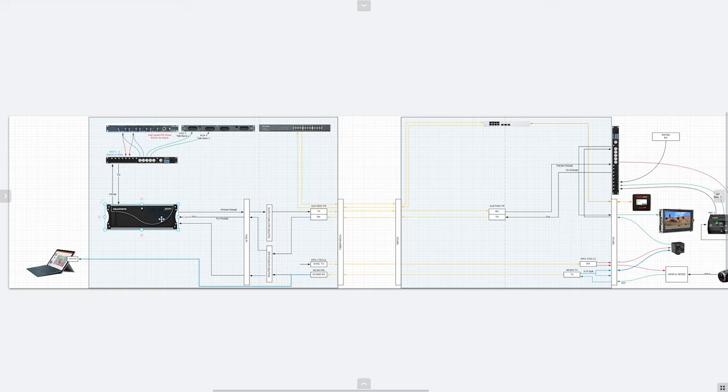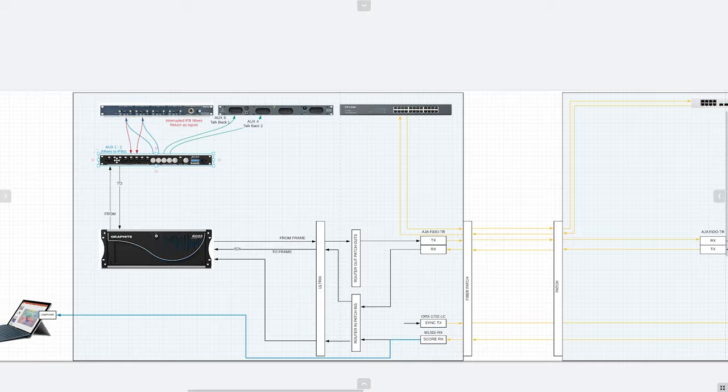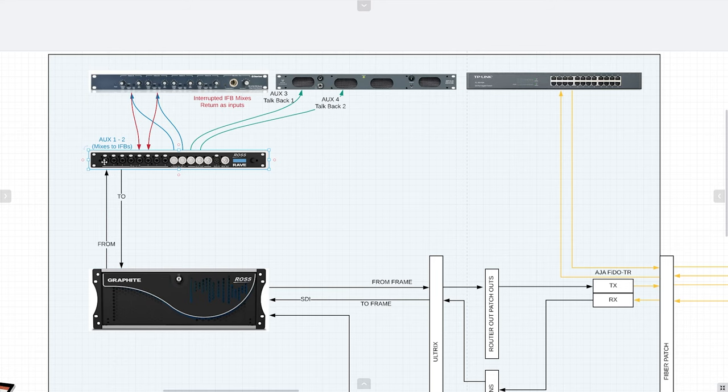video stream. So in order to get analog audio into this SDI stream, they have these unique little boxes that they call ABUs or ABMs, audio breakout units or breakout modules, tomato, tomato. But they just act as little clever embedder, de-embedders for analog audio into the digital audio world of the embedded HD-SDI video streams. So if I zoom in here a little bit, you'll see that there are actually 8 analog inputs and 6 analog outputs, as well as an AES input and AES output, which is still digital audio.